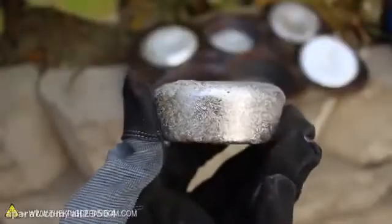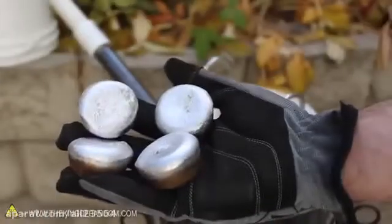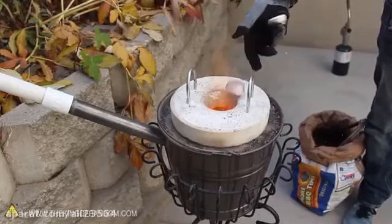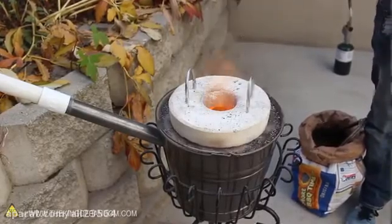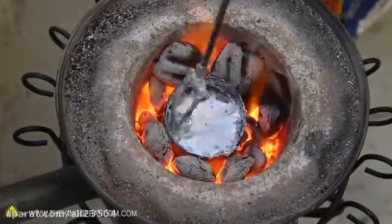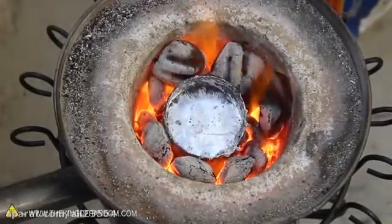The purpose of an ingot is to keep some pure metal handy for when you want to make something cool. So now that we have some, all we have to do is fire up the foundry and toss a few nuggets into a clean crucible. This setup can liquefy ingots in 5 to 10 minutes. By melting clean ingots, there isn't any dross we have to fish out either. Instead, there's only a thin skin of aluminum oxide, which means this entire crucible is full of molten aluminum ready for casting.